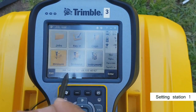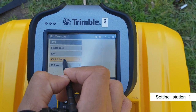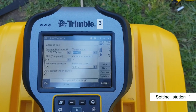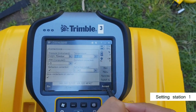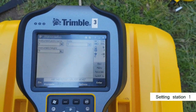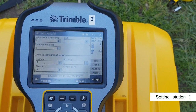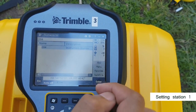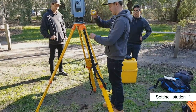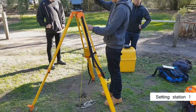We're now up to setting up our initial station. Hit measure, VX and S series, then station setup. Make sure the instrument is leveled and hit accept. Check your corrections. Type in the initial station name — we'd usually like to use one. Give it a station code: 004 station. If you're doing a feature survey which requires levels, make sure to get an accurate instrument height.